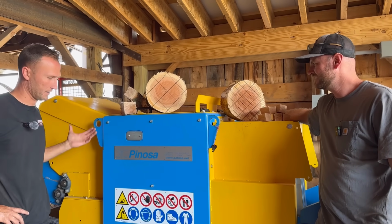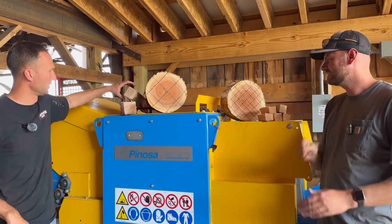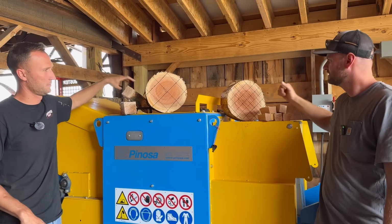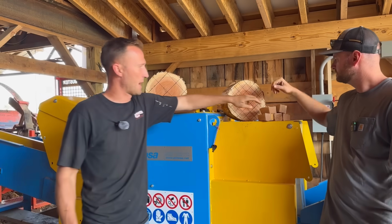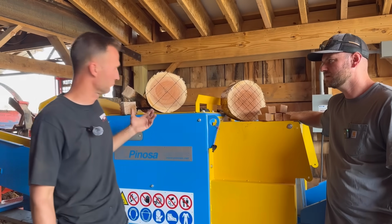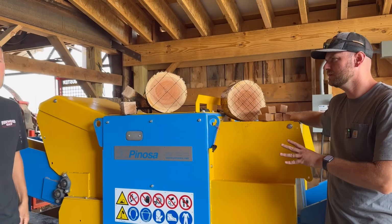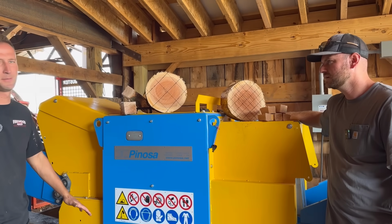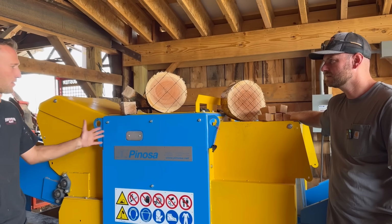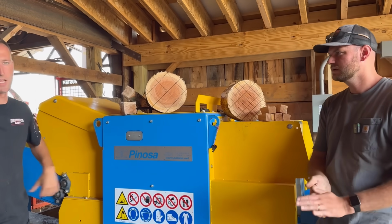It's slick, and it changes process from these size pieces, your normal standard bundle wood, to those size pieces in just a matter of 5 minutes, changing over a couple settings. This has an onboard computer or something. I haven't dug into it to really understand how it works, but it's got to have some kind of logic board. You program how far you want it to advance before it sends the next knife stroke out.